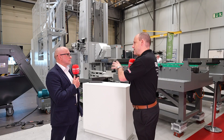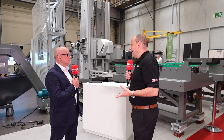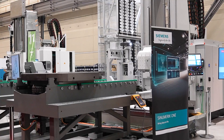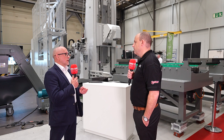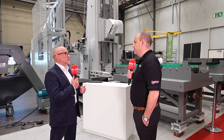For showing your customers, how important is it for them to be able to see the machines — forget the modularity, but let's have a look at how these things are built. Well, the construction has changed as well. So as well as the modularity, the physical parts of the machines are stronger and stiffer, the machines faster, the ball screws are bigger. So you've got a more accurate, more rigid, more flexible system that's modular.